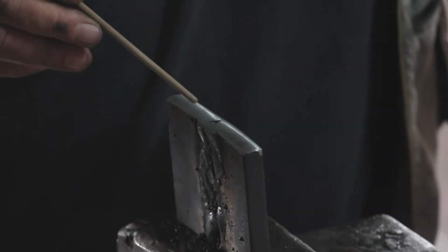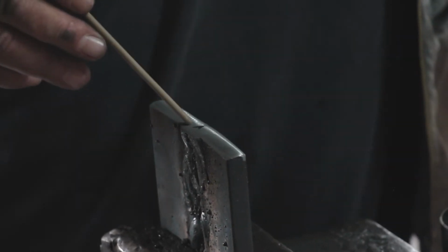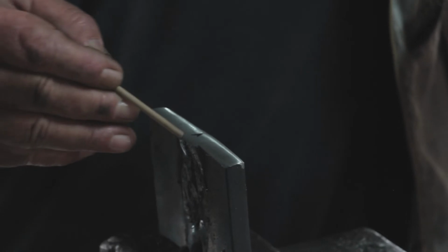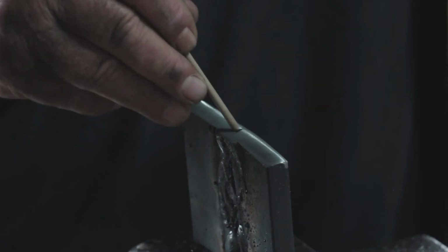If you come in close, you see this is the one that we beat. Now, we didn't actually get a very good weld. This acid's a bit strong. It did actually take to the bearing material on the top, but I think the amount of flux that we had on the rods caused the flux to flow underneath and on top of the material.